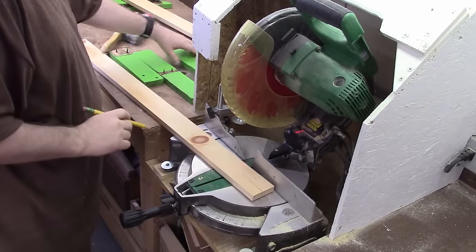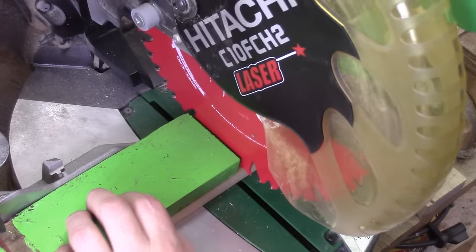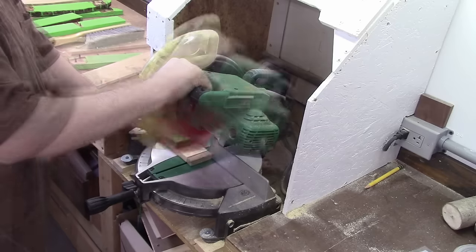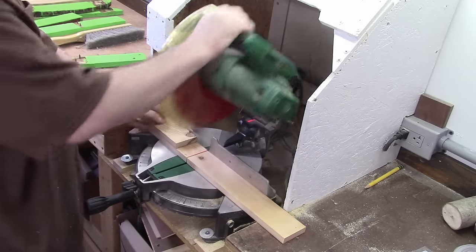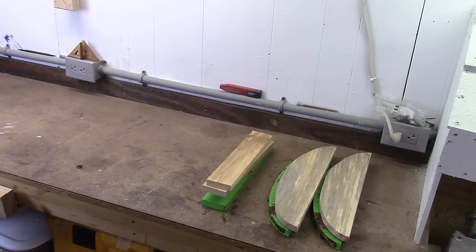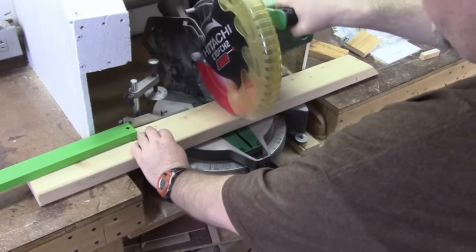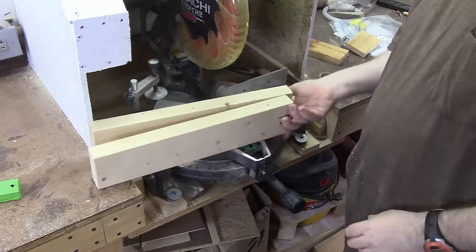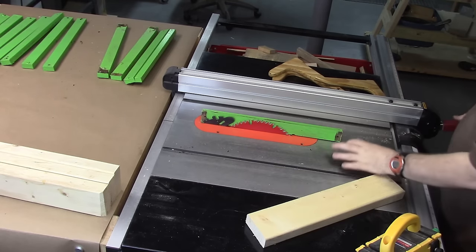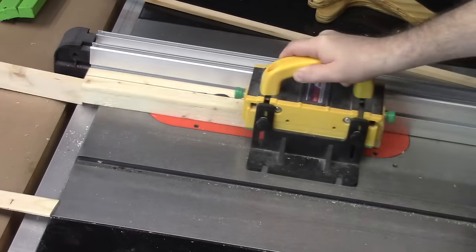Over at the miter saw, I laid down the boards I just cut and matched them up with one of the pieces from the original, using that as a guide. I moved it right up against the blade — no need to measure, I can just cut and continue cutting them to the length I need without grabbing the tape measure. One thing I noticed was the width of the original pieces was actually the thickness of a two-by, so I moved it up and ripped them down using the thickness of the two-by as the width, then cut them to length.